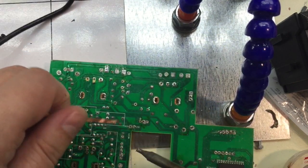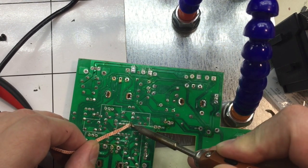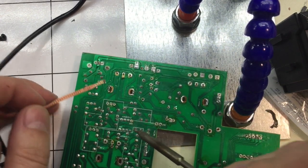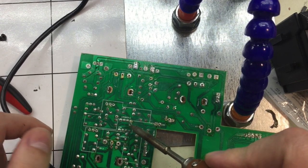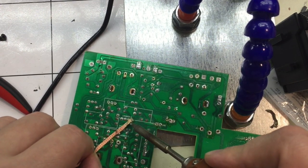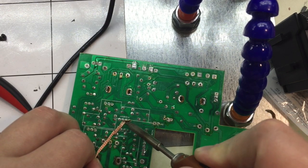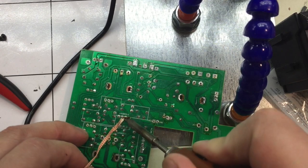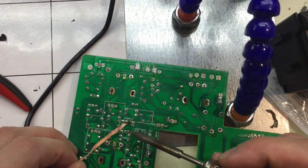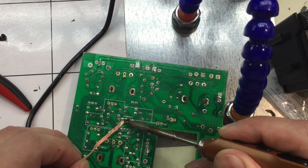I'm going to use my fingers here, but you probably want to try not to do that. So we're going to heat up the joint with the solder wick. And as the name suggests, the wicking action just pulls that solder right off of there. Can you see that? That pin is basically free-standing in there. If I could get this to happen to all eight pins, it would basically just fall out of the board and be ready to replace or salvage, if that's what I'm trying to do. Works really well with the good stuff. Life is too short to have terrible quality solder wick. Sometimes there's just a tiny little trace of solder that can hold the pieces on there, but often it wicks it off so cleanly that the pieces are completely free.